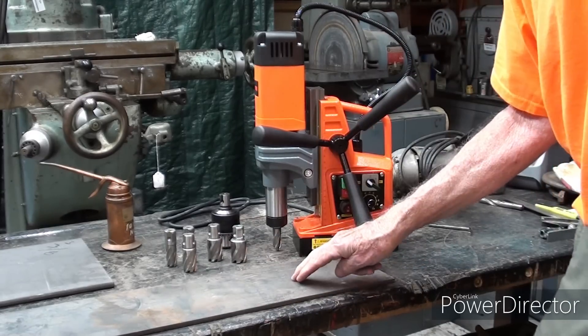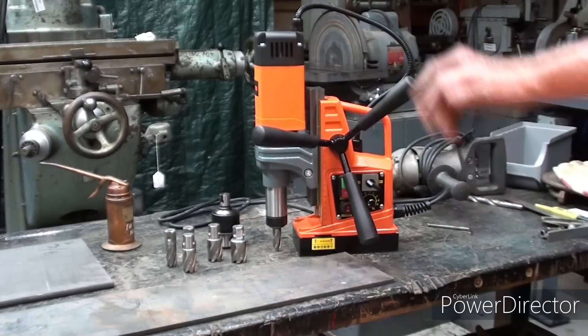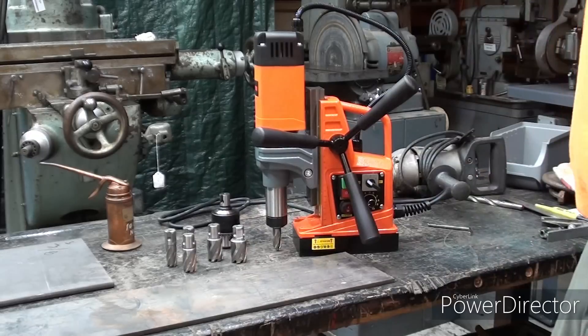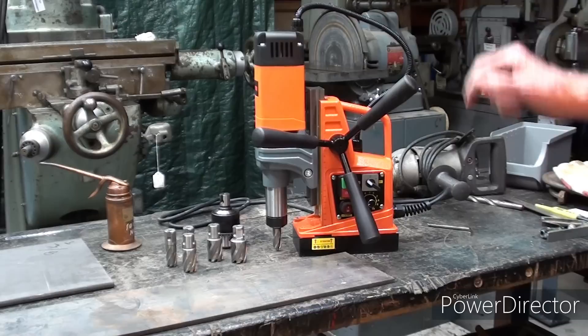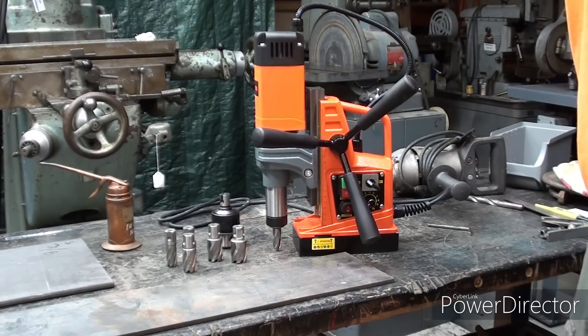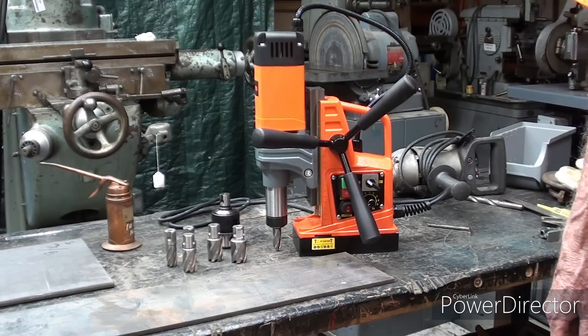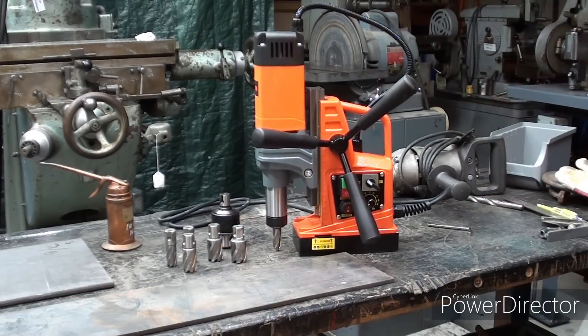What I'm going to do is I've got two steel plates here. This is quarter-inch thick, this is three-eighths thick, and I'm going to drill several holes in that just as an exercise. This is not really a project at all. I got six annular cutters with this machine, but they are metric. The first one I'm going to use is a 21 millimeter. I've been accused of not knowing the metric system, but that's approximately 825 thousandths, which is about 53/64 — let's round it off to 13/16. I'm going to drill a 13/16 hole to start with. I think I'm a champion of the obvious, but let's go through it anyway.